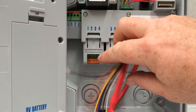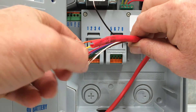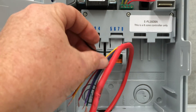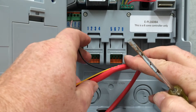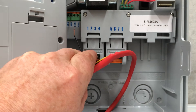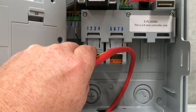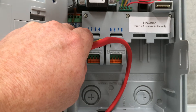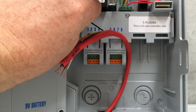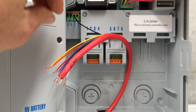For purposes of this exercise I've got the cable and I've stripped all the ends of the cable so we're ready to go. The first cables we want to put in are our common cable. The common cable by standard in the industry is black, and we want to put this one in the terminal up in the top corner here labelled COM. We simply push on this little orange button to release the clamp with a little screwdriver, get your wire in, let go of it and have a tug on it — it should stay in there.